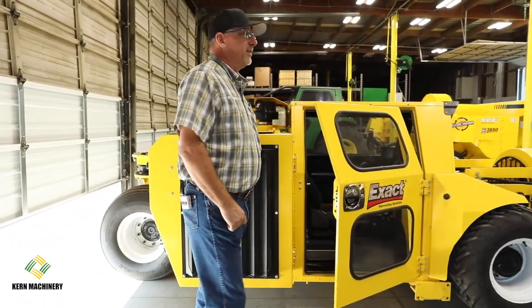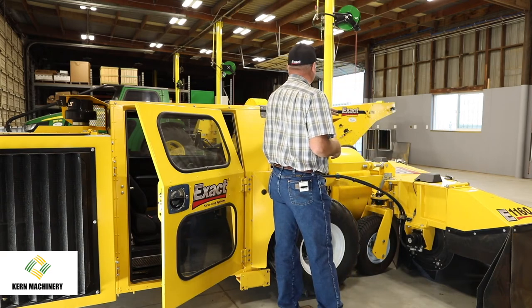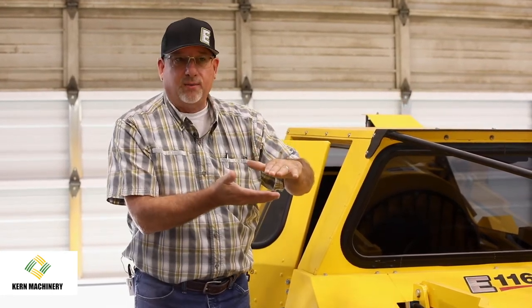You know, it's a common thing that guys are saying, it's more on the harvesters than it actually is on the sweeper. But a guy says, I'm digging on this end and I'm having trouble over here, and I can't keep my head on my pickup set right. You go out there and he's just got three tires that the air pressure is correct, and he's got one that's just a little bit low. There's not a significant amount of weight where that looks like it's flat.